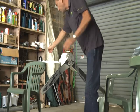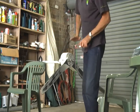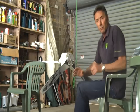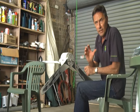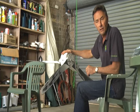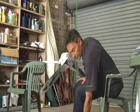The reason for this is we need to make sure that the turbine is completely level. I use a simple level device — you can just move the chair back and forward to make sure that the turbine is level. It's important to say that you need to be very careful with everything you do here; these weigh 15 kilos and could cause serious injury.